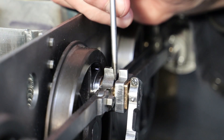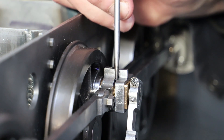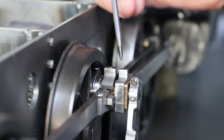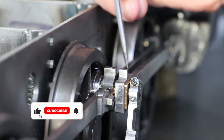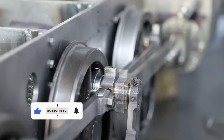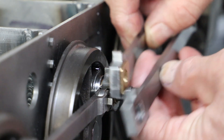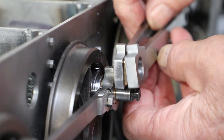At the end of part 39 I was still undecided as to what to do about the gap between the big ends of the connecting rods and the coupling rods. I didn't call it out at the time but I also wasn't happy about the mismatch between the oil pots on these parts. After thinking about it for far too long, I decided the right thing to do was to make new connecting rods.